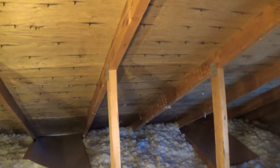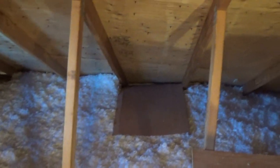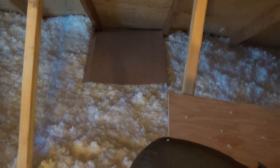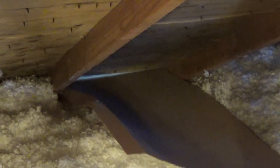So how do you fix this issue? It's air circulation. You do have vents — if you look up here, there's a vent on the roof there, a vent on the roof there, and some vents on the side here. But examining these little vents, you see the cardboard on the insulation there. That cardboard was installed to separate the air vents and allow a path through the insulation, but on the wet side especially, the cardboard is actually pinching off the air circulation through these little vents.